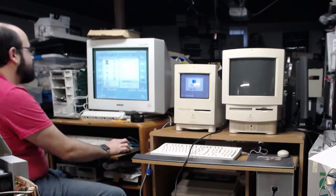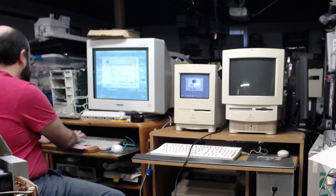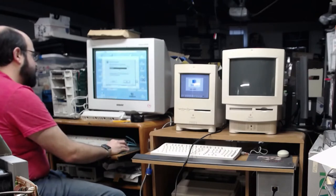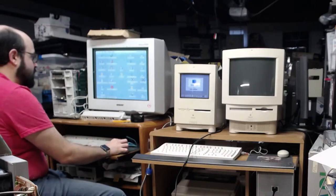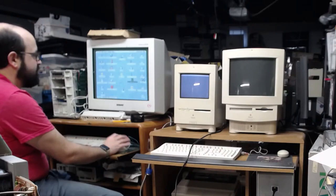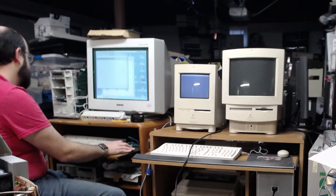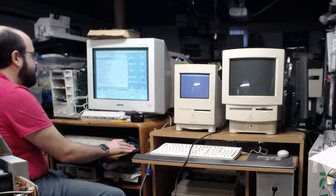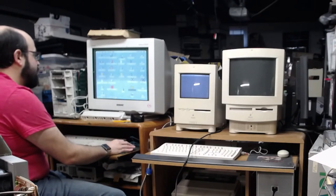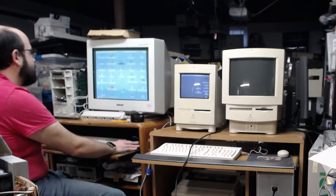Alright, so we're connecting the Quadra to the G4 Mac Mini. We're going to grab that Presto file we need. And I connected the wrong volume. So sorry this is not on the shared screen, I just don't have that set up right now, so we just gotta wait. Okay. Alright, so we have our Presto file here. We copy that over to the hard drive. Okay, so we have that done. Let me open this with StuffIt. We have to decompress it.